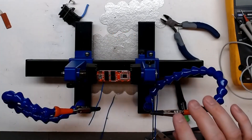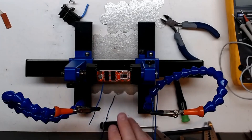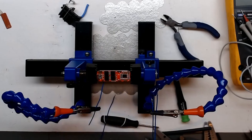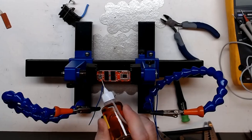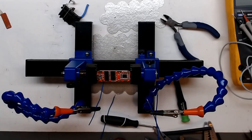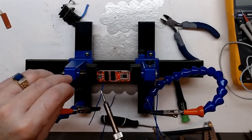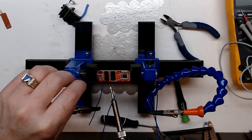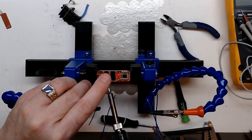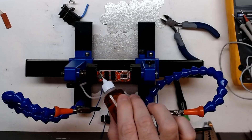Now I'm going to go through with my cell monitoring wires and attach them to B, B1, and B2 - those are our four cell monitoring wire connection points. I'm going to put a little bit of rosin flux on here and go around and put a little bit of solder on these pads. While I'm at it I'll do the B-plus and B-minus pads as well.